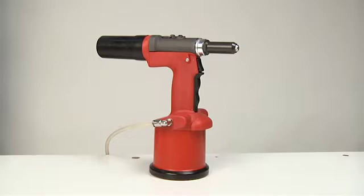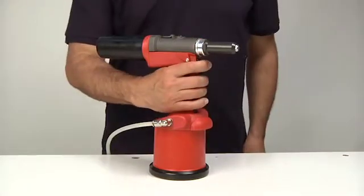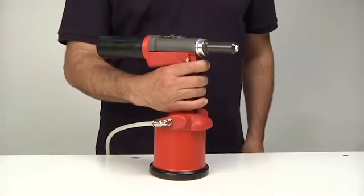We recommend supplying the machine with compressed air. Operating pressure must be equal to 6/7 bar, only after having checked that the oil tank plug is tightened properly. Run a few test cycles to check the operation of the riveting tool.